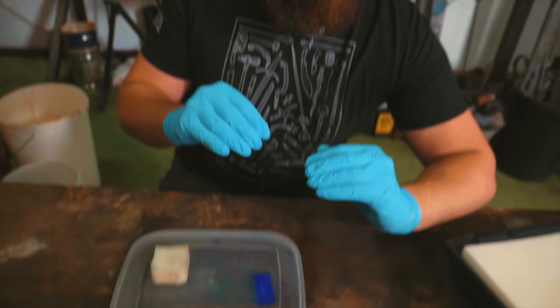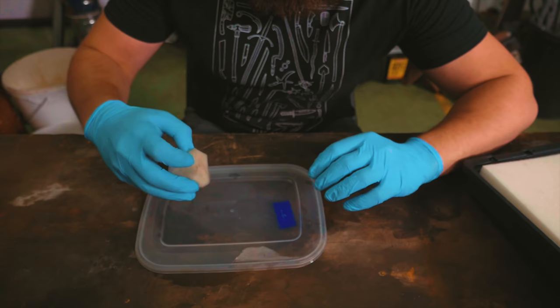It helps the polymer, which the Dyna stencil is made of, to cross-link, form a bond, and basically that means it just hardens it out. Now, the black on the stencil that we put in there blocks the UV light, meaning that that section won't harden. So now I should be able, after developing, to just wipe that part right off.